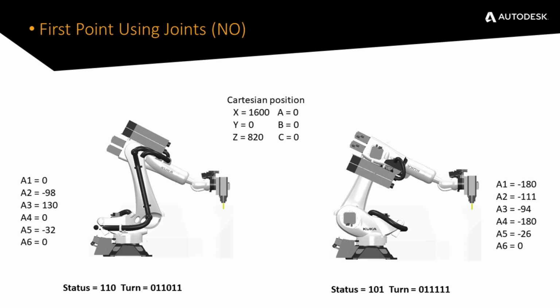You see how it's backed upon itself, and you look at the cables, they look all stretched. It doesn't look comfortable. If you were trying to write with a pen and had your arm twisted the other way around, that's what it feels like: you've got yourself wrapped up in a twist. If you define joints, you can make sure it's not in this wrapped up scenario. But if you don't, then you risk the robot choosing the wrong solution.